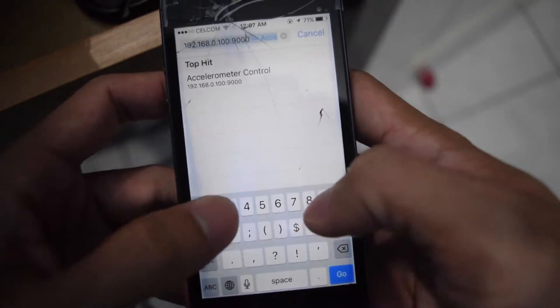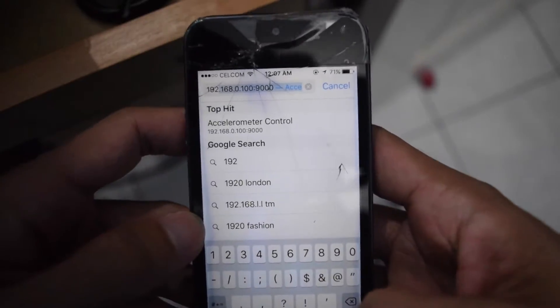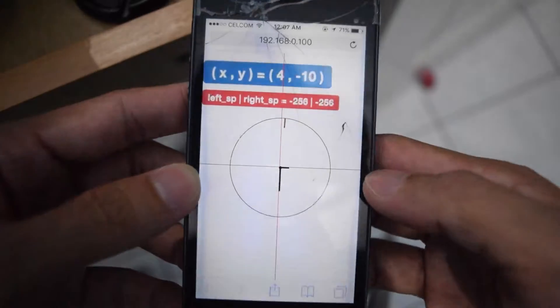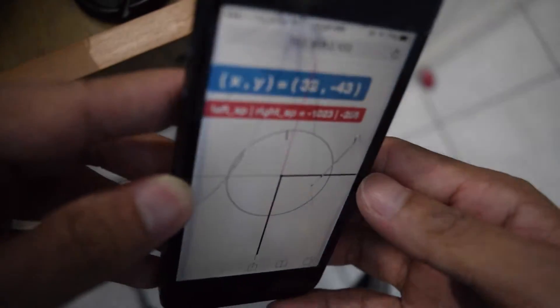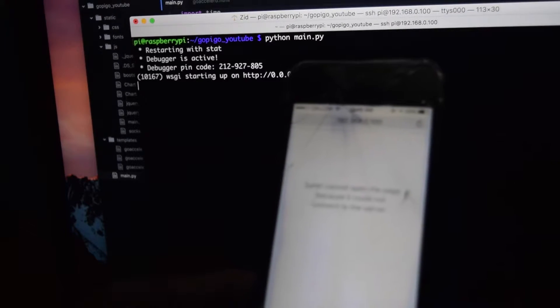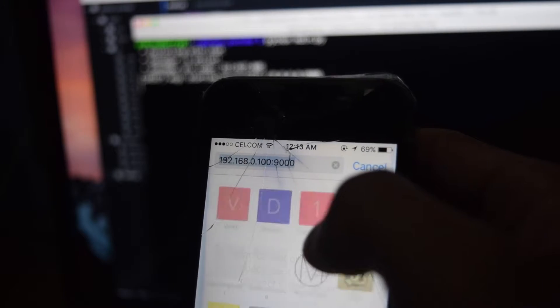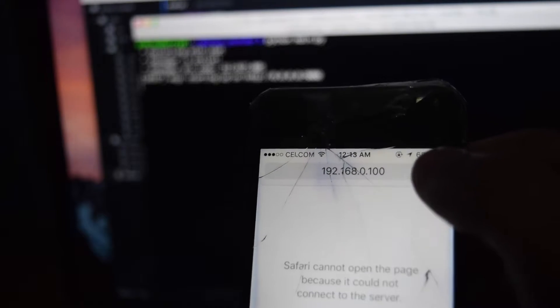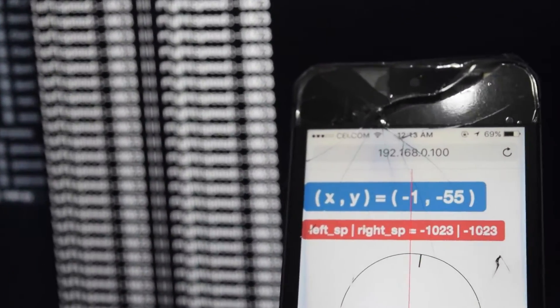For controlling the Pi using a mobile web browser, we need to have some kind of protocol to allow communication between the Pi and the browser. To do that, we can use a protocol known as WebSocket. WebSocket is a powerful and efficient method to allow Raspberry Pi and web browser to communicate with each other in real time. What we need to do is: first, create an HTML web page; second, use a Raspberry Pi to host a web server to serve the web page; third, create a JavaScript code to handle accelerometer readings obtained from the HTML; and finally, send the processed accelerometer readings to the Pi using WebSocket.